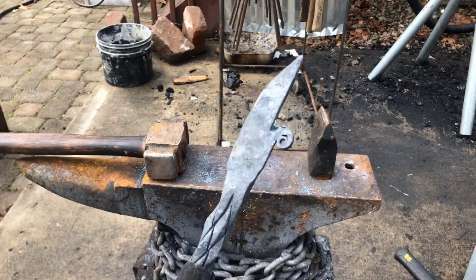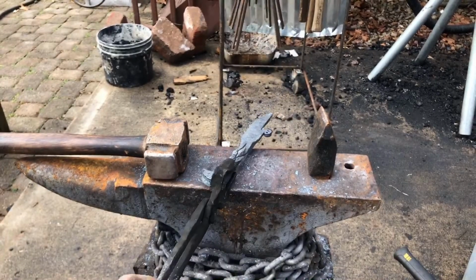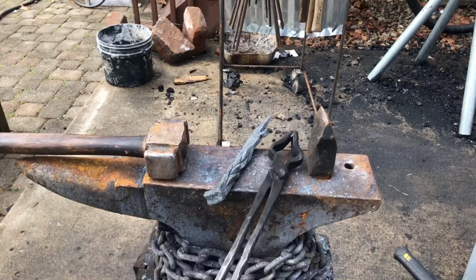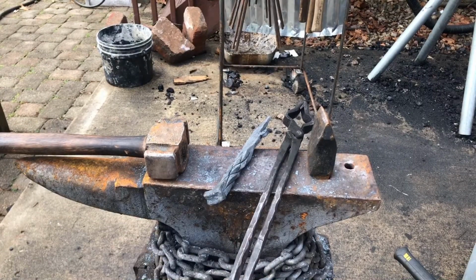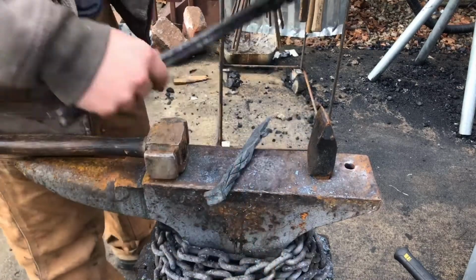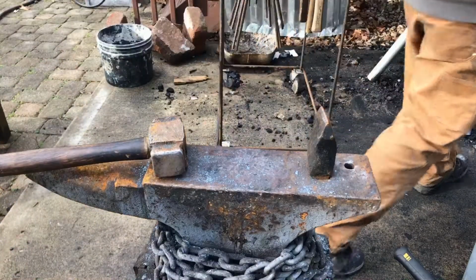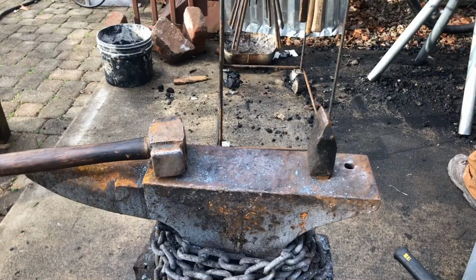And then I actually have a very exciting new piece of equipment in my workshop. I went on Amazon and got a 1x30 little belt grinder, because my big belt grinder is not made precisely, so I can't do plunge lines on it, but I can now do plunge lines on my knives, which just adds that extra little bit of quality to the things that I make. So I'm very happy with it.